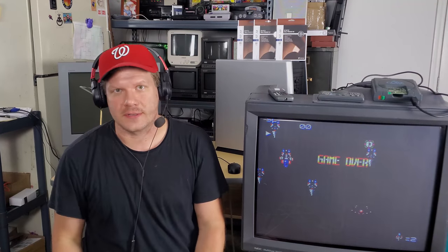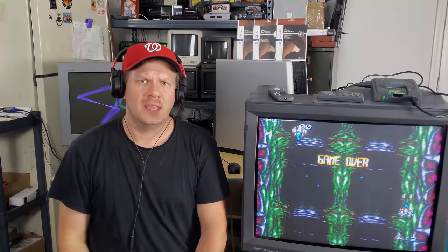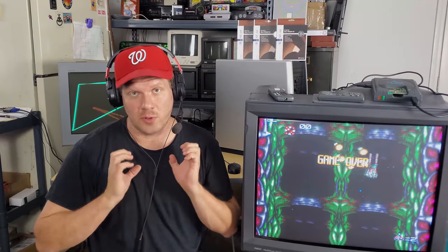And heat is really the element where it starts to stress them out and put stress on the parts and break them down. So adding that cooling system is a benefit that I think we could even really go in and study and maybe add fans into some of the Sony BVMs and PVMs and other Ikegamis and JVCs that are high-end that don't have fans. We could put fans in there to blow cool air over those hot zones, and that way we can extend the life of the boards and the components in there already.